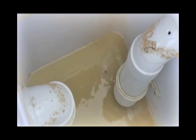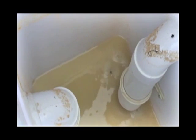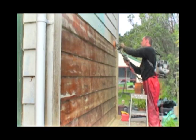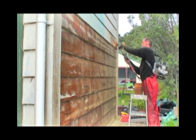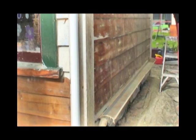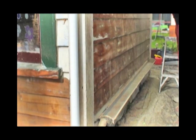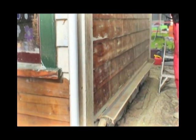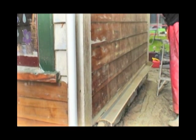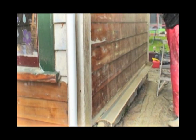When using this system you don't use the enviromat as much. It's a personal preference how you set up the guttering. You could set the guttering up so that it fits the length of the wall to be sanded, in which case you will need to purchase more guttering from your local hardware store and cut it to fit the length. Alternatively, it is easy enough to pre-fit the brackets for the whole wall, set up the guttering either to the left or the right hand side, sand or strip part of the wall above the guttering, and then simply move the guttering along the wall.